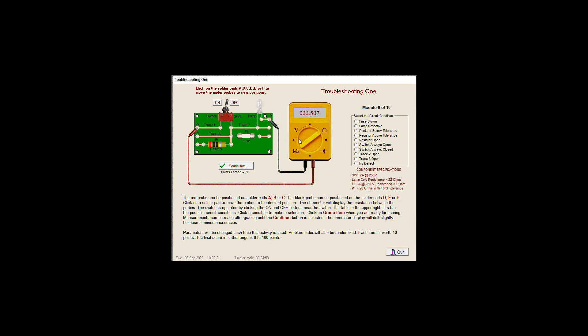So our lamp is 22 — 22, perfect. Let's go down here and check our switch. Our switch is all the way closed. Turn it on — switch is good. Our traces are good. Our resistor is 8.4 — that's way out of whack. Let's go ahead and check our bulb — bulb is good. So resistor is below tolerance.